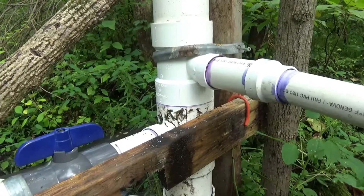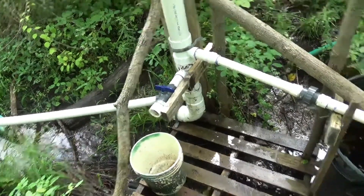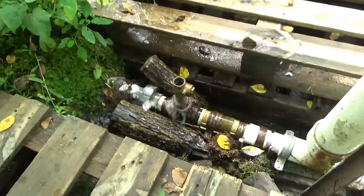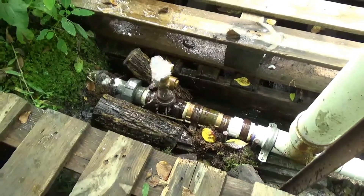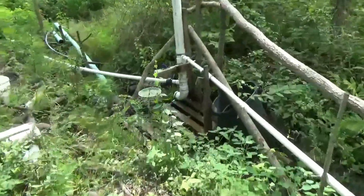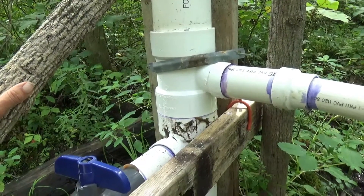It's the next day and it turns out our water supply is still quite low. The upgrade did give us some operational functionality — we aren't running on any of the big valves, but we are running the three-quarter inch valve, which delivers about a hundred gallons a day. It's not a tremendous amount, but at least we're moving some water. Either way, when the water levels come back up we now have a little more buffer in the standpipe over the intake of the drive pipe. Maybe not super successful, but we are pumping some water and I consider that success.